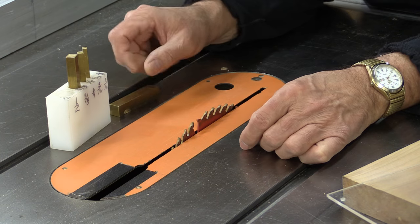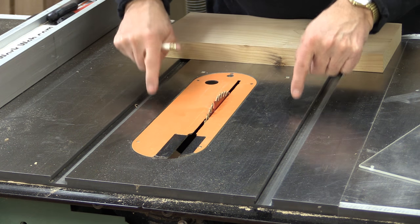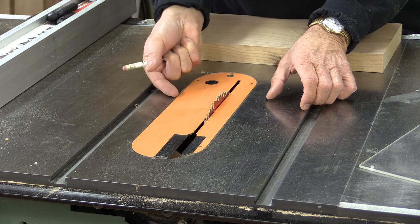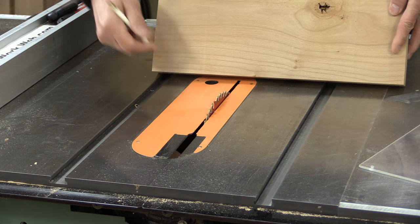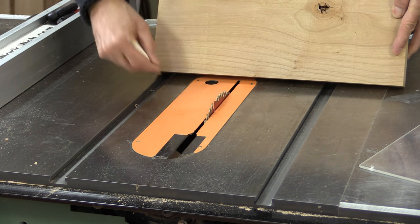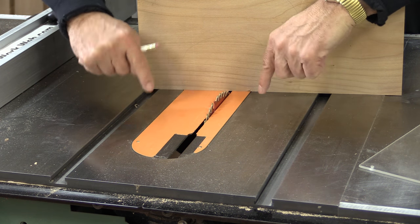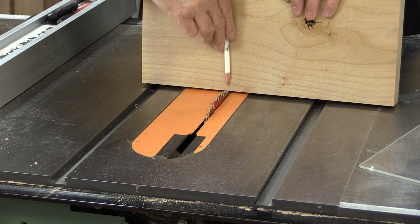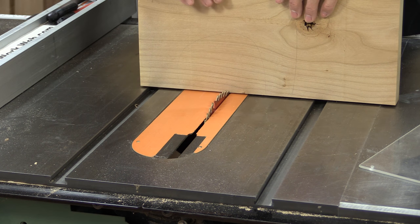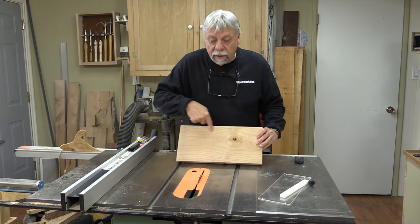Here's what I want to build. I need to measure from the actual table to the blade, so what I'm going to make is a U-shaped type of thing with feet — the feet will be on either side of the table, and in the middle there will be a rod that moves up and down to set or measure the height of the blade. And that's what it'll look like.